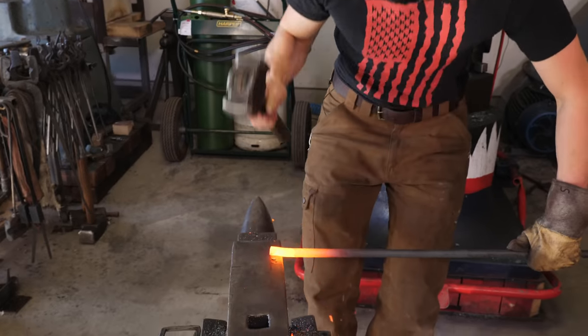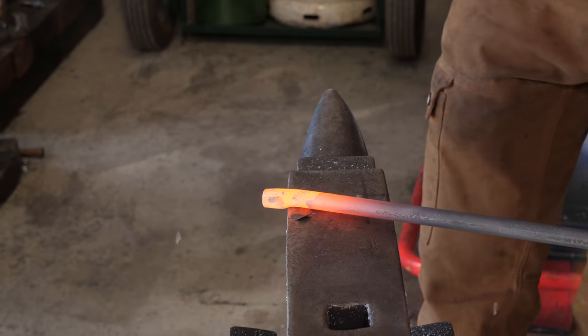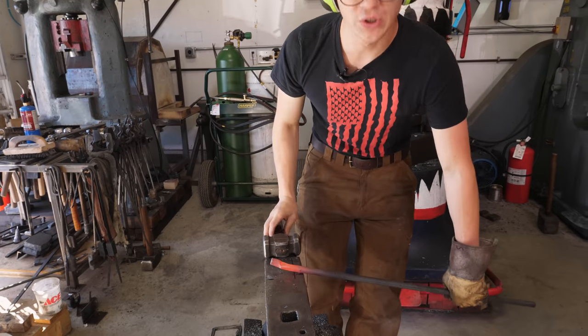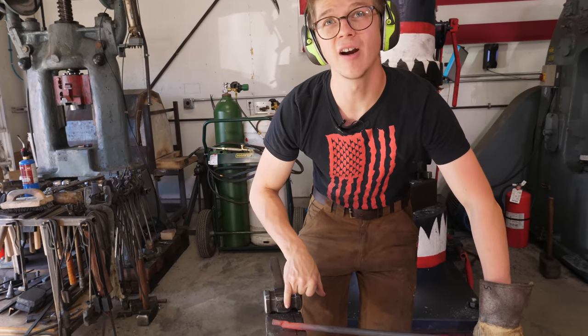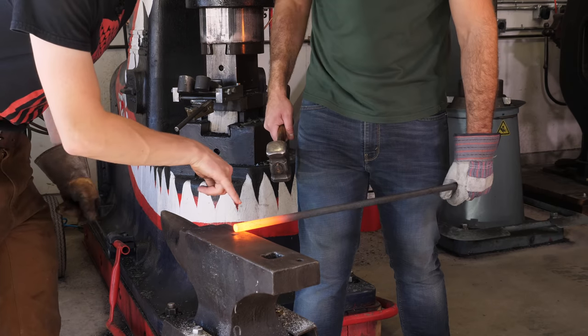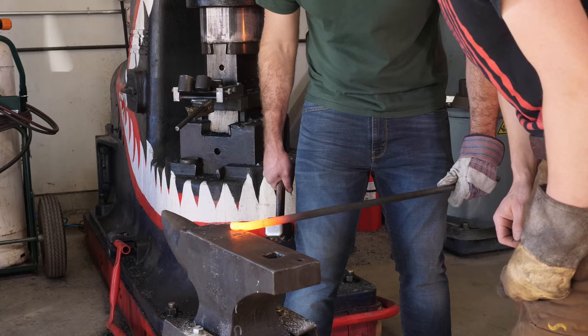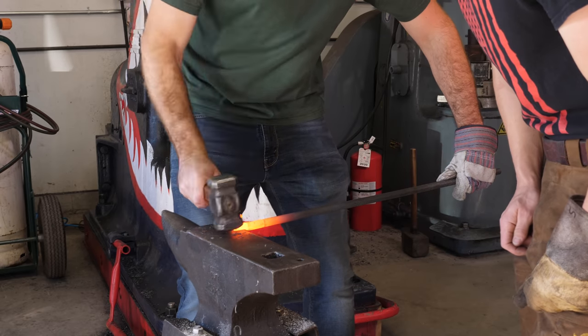So I'm going to take the round side of our hammer, line up the bar here. Now I take a left turn. I come to the far side of the anvil. Another left turn. And so what we're doing is we're just isolating mass for the jaw, for the pivot area, and for the reins. You're up with the round side of your hammer, you're aiming in the middle of that edge. Very good. Feel for the shoulder, you've got it. Two hard blows. Love it, good posture.